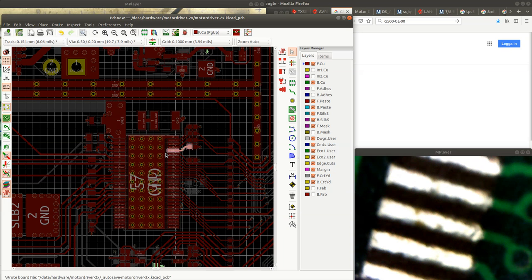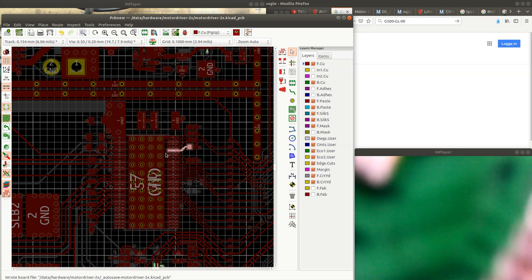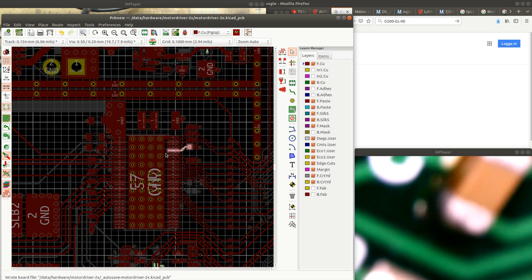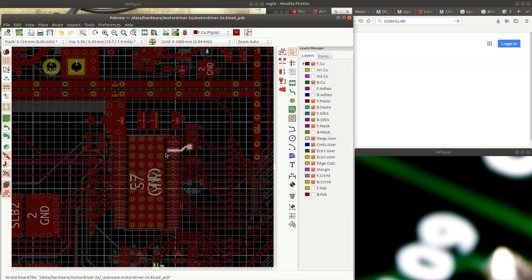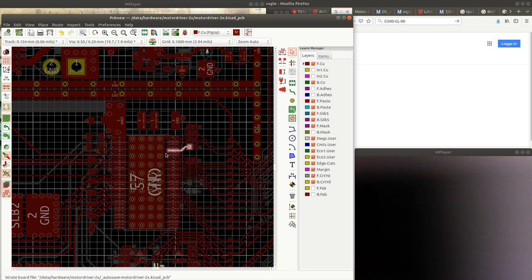And let's put it back now and see what we get. See if we can power on the board. I hate it when the pads have a little bit of solder on them, because then the chip just slides, and it slides into the grooves between the pads. So this is really nice.